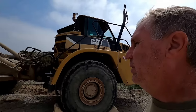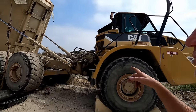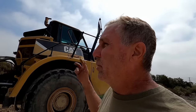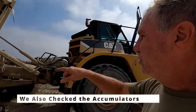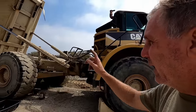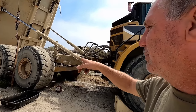Welcome back. Today I've got a video on doing a brake job on a Cat 740 — a late serial number B1P, built around 2011. The symptom was that when you hit the brakes, the alarm would come on after just a couple seconds saying you had low brake pressure. We checked the pump, the pressure reducing valve, and the check valve — all fine. So we capped off the supply going to each wheel, and this right center wheel was the problem. Once we capped that off, the alarm quit going off when we hit the brakes.